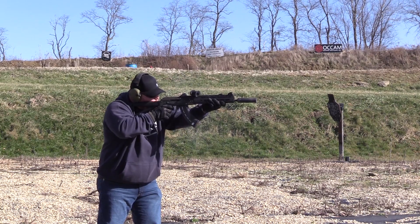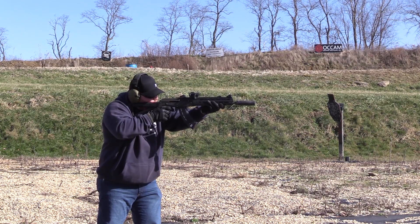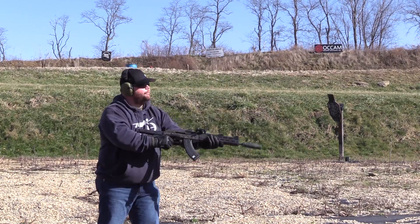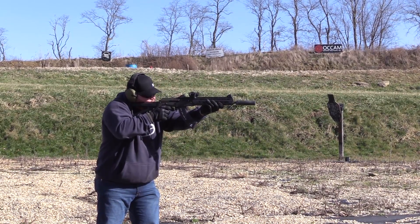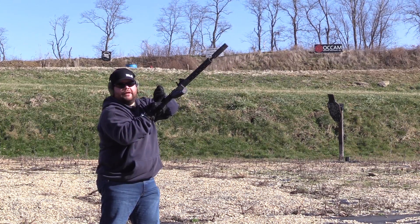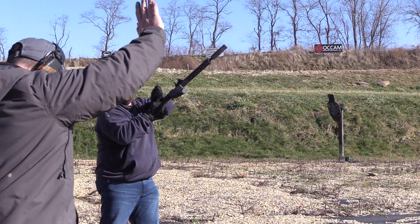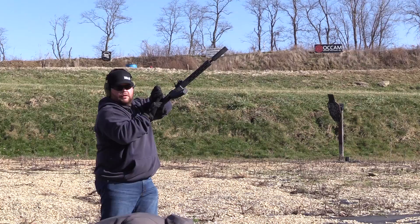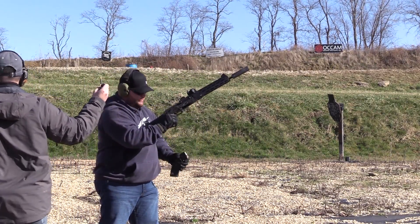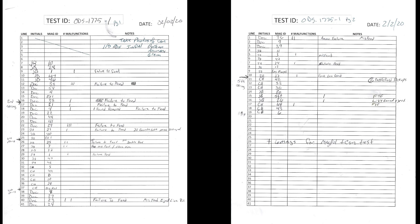Now that said, what was happening with the gun? Periodically we were seeing a live round be ejected from the gun in the loading sequence. You guys see that? This is a magazine failure — this round came out of that magazine. We're not talking like this happened once or twice; we're talking like this happened about 20 or so times during the initial run, and that is indicative to me of some kind of systemic issue.